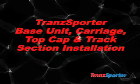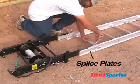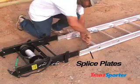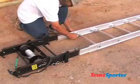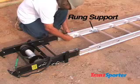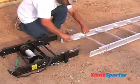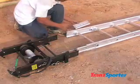On the LH200 series shown here, remove the splice plates using a socket wrench. Save for future use. On the LH2000 series, leave the splice plates on the track section. For proper orientation, please note that the rung supports are underneath the track rungs when splicing. Also, each track section has a front and back side.